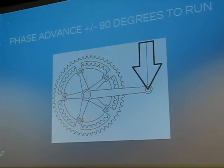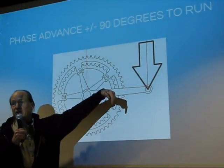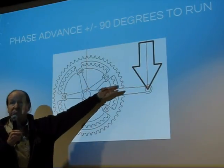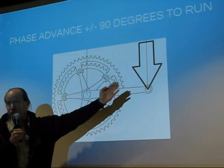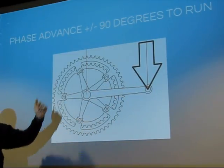On a bicycle, you always want to push when the crank is straight out, because then you're pushing straight down. And so we electrically determined where this was. You just have to subtract 90 degrees, and that's what your phase should be. If you're at this position, this is what you have to output, and it'll go. And if you want to go the other direction, you just put the phase over here, and the motor goes in the other direction. It's that simple.